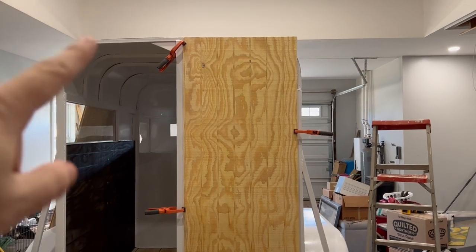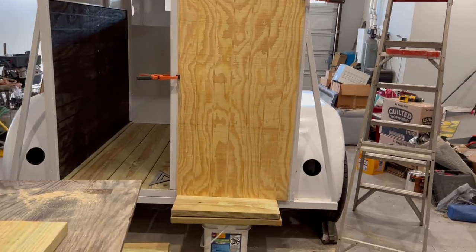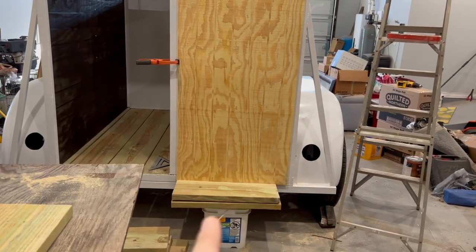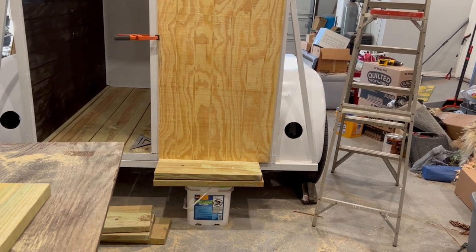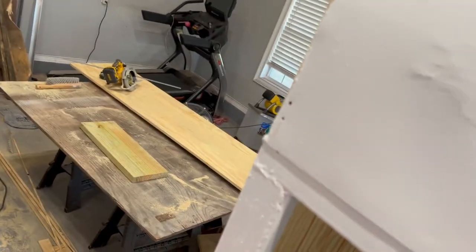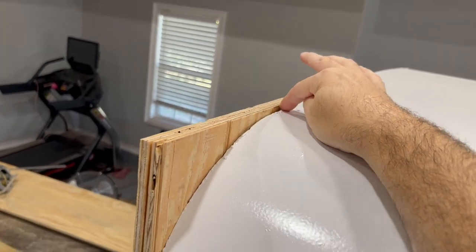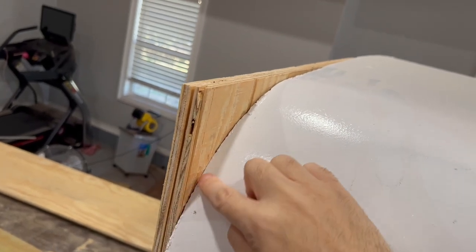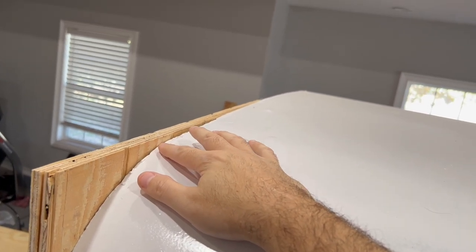I've got this formed up — see that curve? There's a curve behind there that I want to trim up. I've got it clamped into place. I've got two of the two-by-tens, the ends I cut off from my floorboards, sitting on top of a bucket of kitty litter — you got to do what you got to do. Up top here, I'm going to put a mark so I can trim that curve and go an eighth to a quarter inch inside that mark to cut and trim it up.